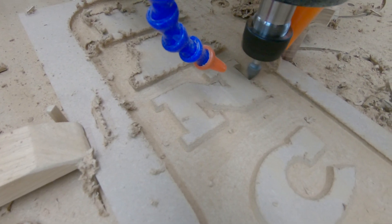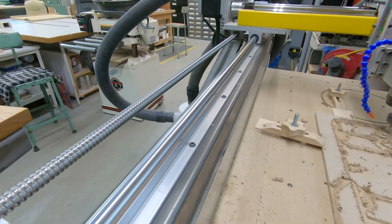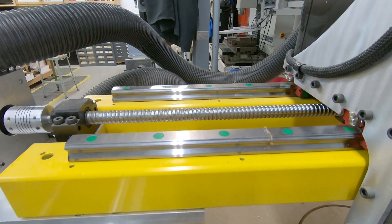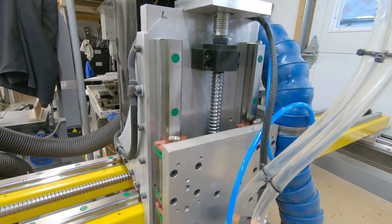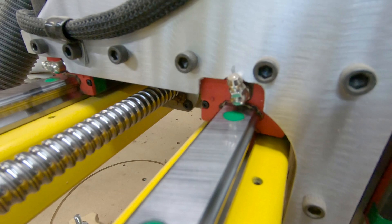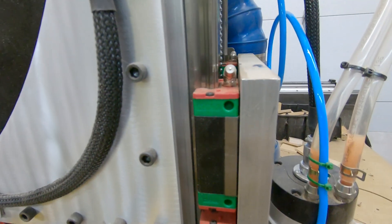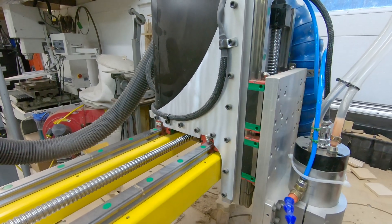When it comes to the motion controls on the machine, I'm still running the round inexpensive Chinese rails that I originally had on the Y-axis, but on the X and the Z I've switched to name-brand Hiwin rails. They're quite a bit more expensive — had I known how successful this machine was going to be I would have spent the money up front. What drove me to make this change was when I started doing drilling operations and when the cutter would come down against the material I could see the entire axis — the Z and the X — shift a little bit. These rails locked all of that down, and they're smoother all around.